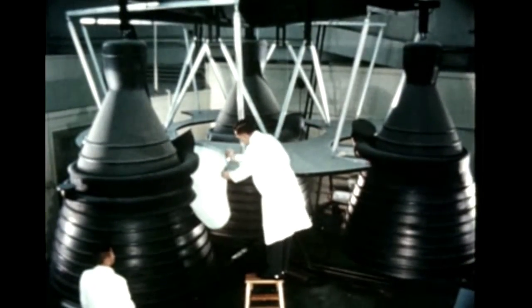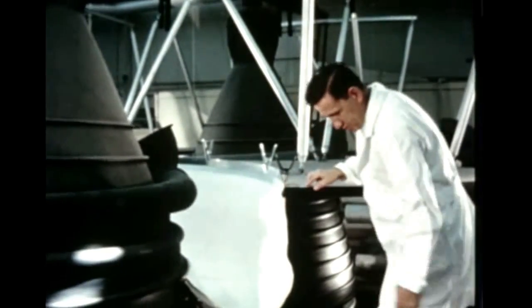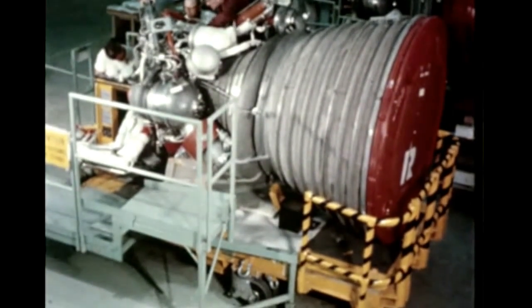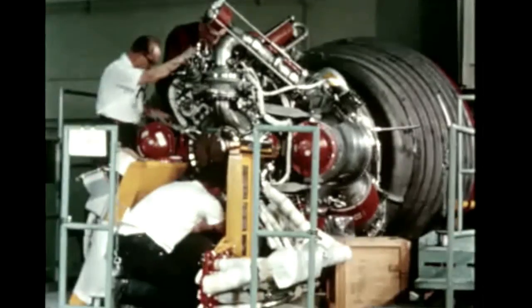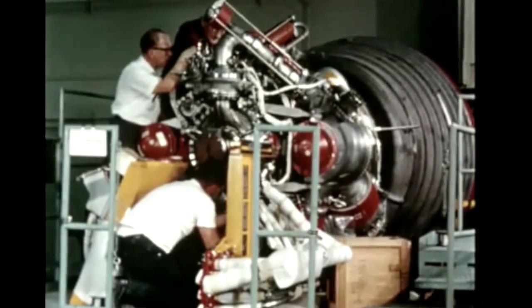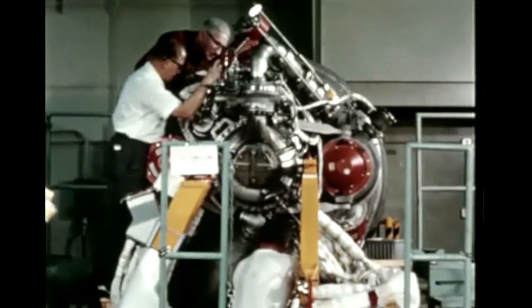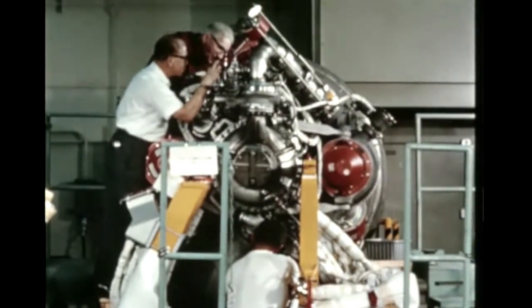Study of the base area portion of the S-2 electro-mechanical mock-up has provided S&ID engineers with information pertaining to the installation of the heat shield. Two J-2 engine simulators were also delivered to S&ID. The simulator is a functional mock-up of the production engine and is used as an advanced vehicle development aid. Valves, electrical, and ignition systems are production hardware and are operational. Components that do not operate during pre-flight checkout are hard mock-ups, but configuration, weight, and installation conform to system design.